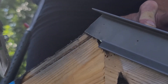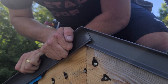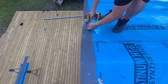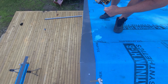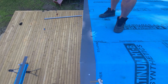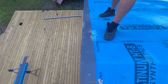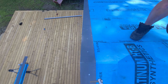Now that the lines are made, remove the piece. The first cut we're going to make is on the opposing gable trim — all we're going to do is cut off the drip edge portion, leaving the rest that will act as our underlapping allowance to finish the miter to perfection. The piece that was removed has a mark on it; remember the mark is to be connected to the top corner like so — this gives us our finished miter line. Once you've made this line, cut along it and remove the scrap. Now that all the preparation is done, install the last piece while properly hooking everything together to finish off this wonderful trim detail — the gable trim detail.